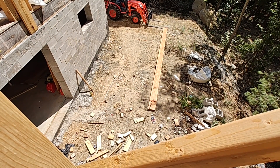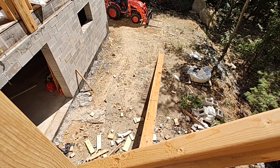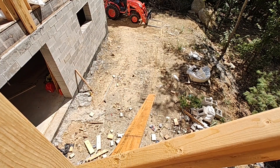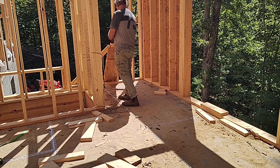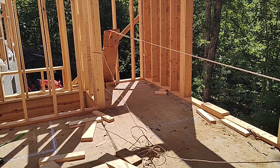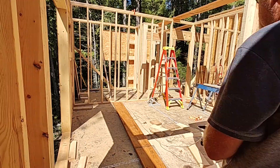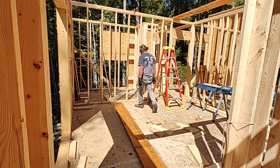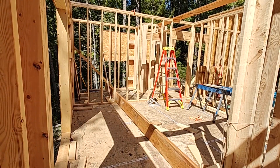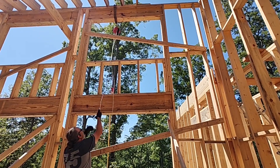Unlike the kitchen section, which was very open, having the interior bedroom walls up makes landing the LVLs a little bit easier but it's trickier getting them up because the space is tighter. However, because we don't yet have sheathing on these side walls, it does give me a through-passage on the near side and the far side so I can just get it angled.